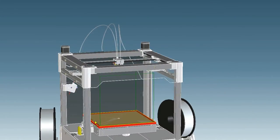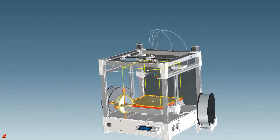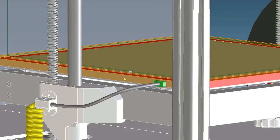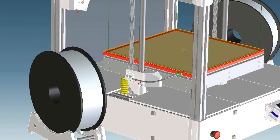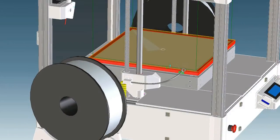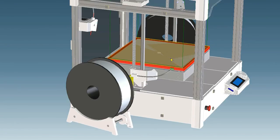This green cube here is the build volume — it is 300 x 300 x 300 mm. The printer will have a heat bed. It rests on three points on three screws that can be adjusted to level the bed. For the bed motion I decided to use two steel rods and two spindles on each side of the bed. Some printers have only one spindle and two rods in the back. When you have a really big print bed with higher mass, it might happen that the bed swings up and down while traveling upwards. If the printer wants to measure the home position of the bed it should not swing like hell, resulting in a measurement error.